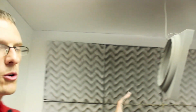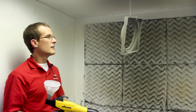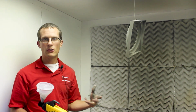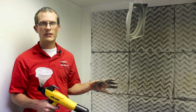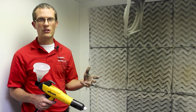You can hear, because I don't have my ground on, ultimately you'll generally want to hit the whole part prior to hitting the spot where your grounding cable touched, so that it is not building excessive charge, and then you'll have less issues with back ionization. So this is some of the basics of how you shoot your powder coating, so that you don't get issues like back ionization. You cover your surface effectively, especially in Faraday cage or second coat applications.